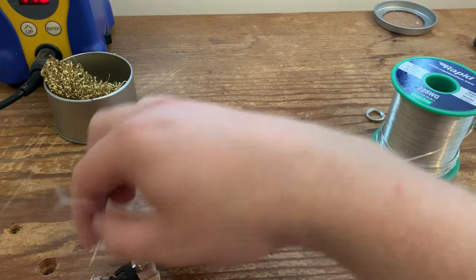And we're going to do exactly the same with the bridge pickup. So the inner cloth wire goes to the input lug again. Just going to turn that around, which is this lug here, the outer lug. So reheat the solder, connect the signal wire, and then exactly as before, we're just going to ground the pickup, the outer braid to the pot.